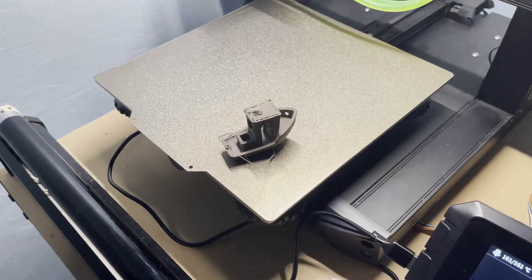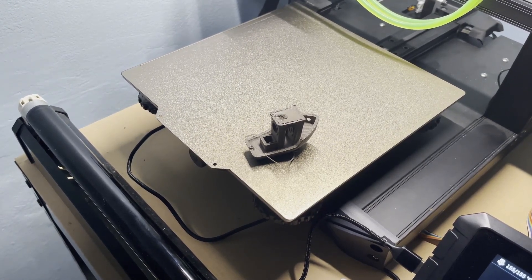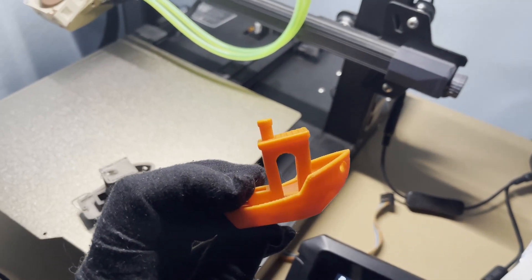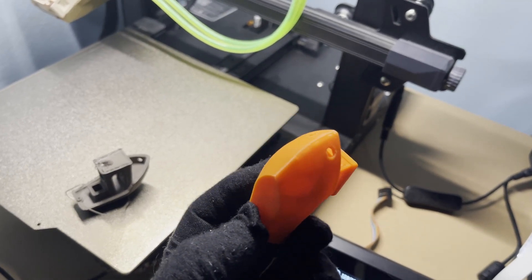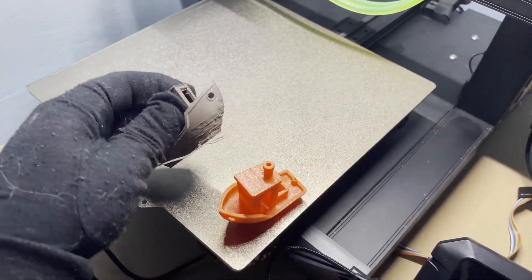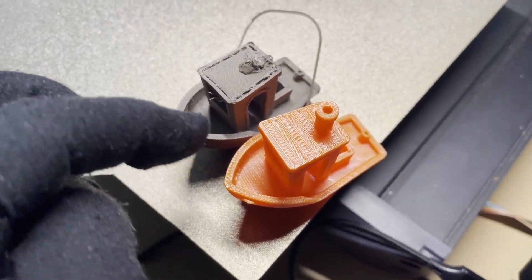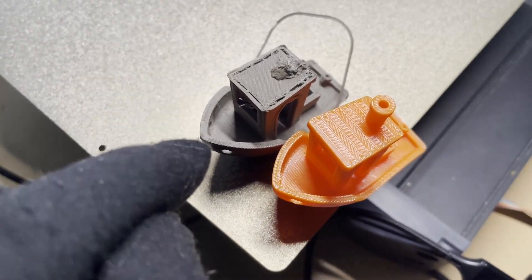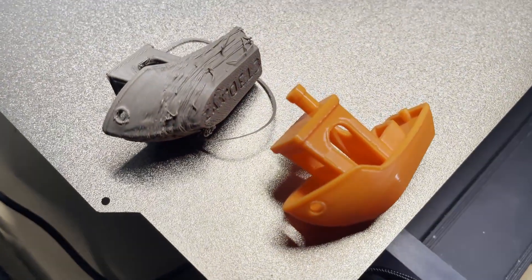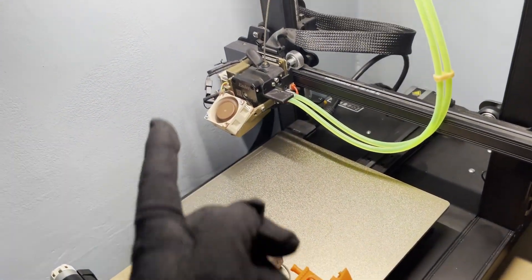Let's compare this to the Bambu — it took around 35 minutes to get to this stage. Let's check what a Bambu 70-minute Benchy looks like compared to this one. So guys, this is the print from the Bambu X1 Carbon — it's a 70-minute Benchy. You can see there is proper cooling on this because there are no imperfections or layer skipping whatsoever. Compared to this one, which is a 35-minute failed print, if you put them next to each other they're almost identical from this angle, but when you look at them sideways they're not.